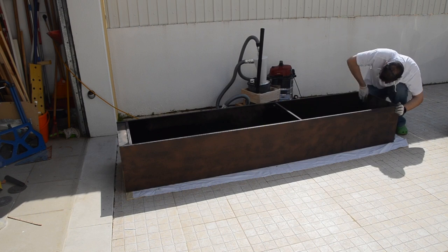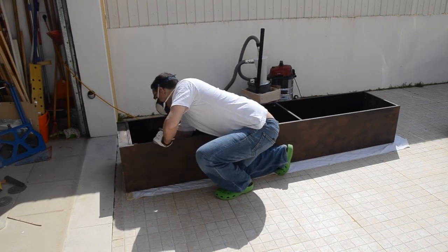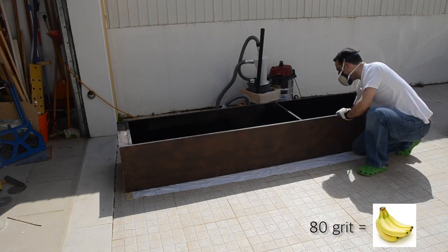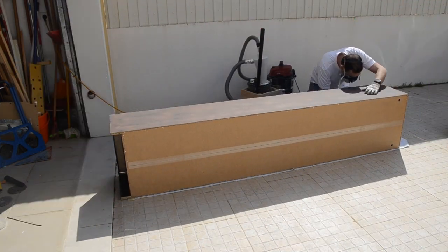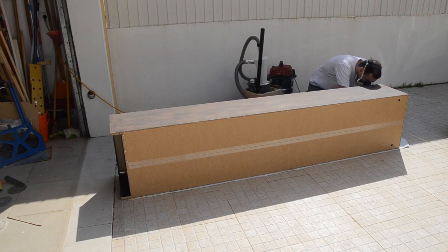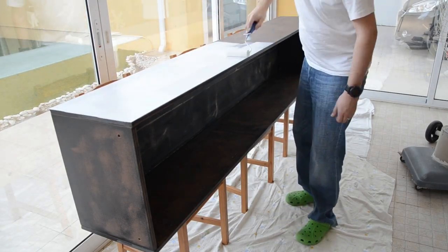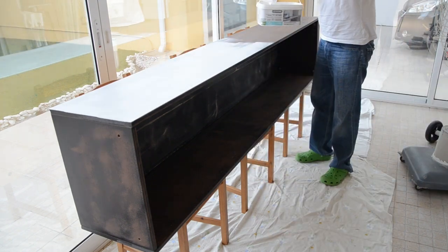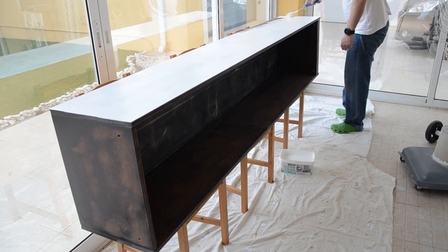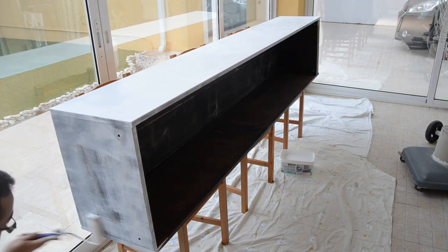I had to scrape it off and decided to do some sanding before the primer. I started very lightly with 180 grit but wasn't happy with the progression. I went down to 120 grit and after getting bored of sanding I just went full bananas with an 80 grit pad on an orbital sander — that's what you've been seeing me do until now. Be careful, as the 80 grit can expose the inner IKEA material quite easily. If you're looking for a glass-like finish you might not get it at this grit, but if you can live with a little texture, this method works really well.